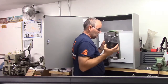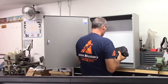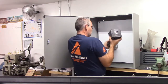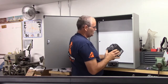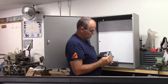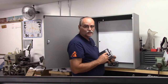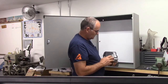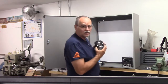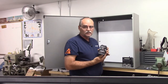And I've also got another VFD that needs to go in here. This little guy here. So I'll keep these relatively close together. This is the spindle VFD. It's a Teco LF510. It'll take single phase in, 3-phase out. It's for 3 horsepower, 2.2 kW rating. So I'm fond of the Tecos. And then this little guy, this is a 1 horsepower Teco.